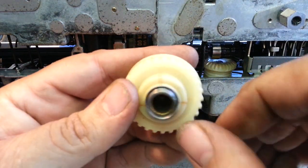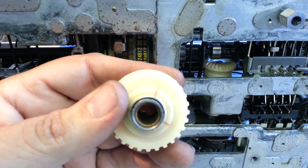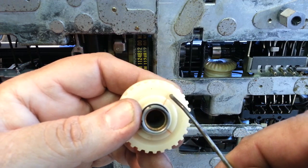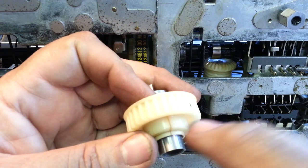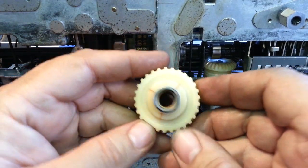The other method is drilling or melting a hole right up here, right on the edge at the end of that crack. You do it to all these cracks, and hopefully that stops the crack, stops the stress, stops the crack at that point and doesn't let it get past. So that's the theory behind it.